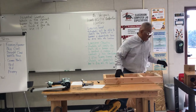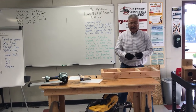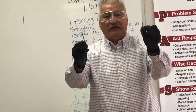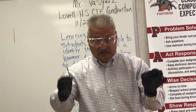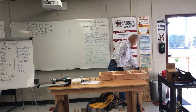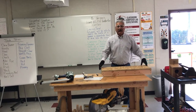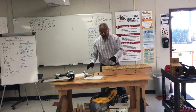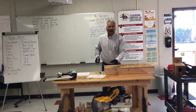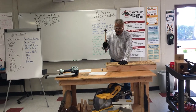We have another nail called the 8-penny nail. It's a little different size — a little shorter. The 8-penny nail is used for putting on paneling. This is a piece of bead board. Same thing — hold it over here, get it started. Notice how I hold it — hold it above my ear and begin to hit it.